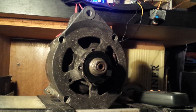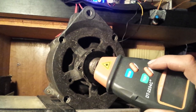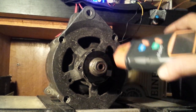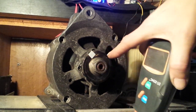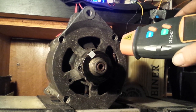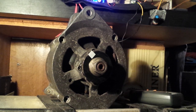Like in the previous one, I'm measuring the RPM with this digital laser tachymeter. I press the button when the motor turns, and the laser beam measures the RPMs — it counts every time the marker passes the laser, and that's how you come up with the RPM.